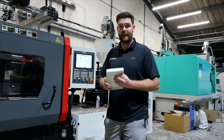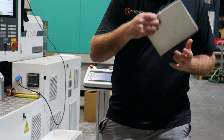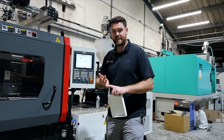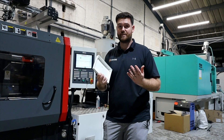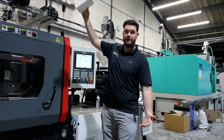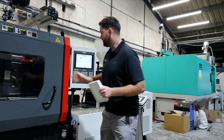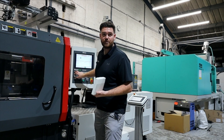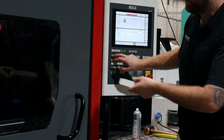So the part's been packed out, we've gone through the holding phase, and now we're into the cooling phase. This material has to cool and set before it can come out. That can take anywhere from a few seconds up to a few minutes, depending on the size and intricacy of the part — a larger part is going to take a lot longer to cool than a smaller one. Once cooled, we're going to open the mould.